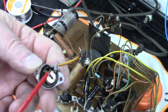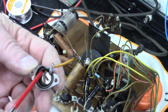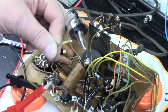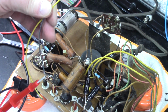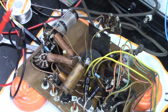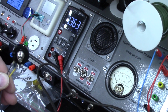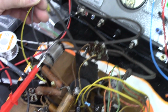The wire is broken, I can't fix it. So I'm thinking, based on where it's at, it's probably sitting at around 1200, 1300 ohms. So here's what I did. I have this 2K pot that I've added some leads to, and right now if I aim it so you could see my multimeter, if you guys can see that, it's sitting at 1362. That's where I set it. I figure that's where I'm going to set it to start with, and then we'll see what we get.